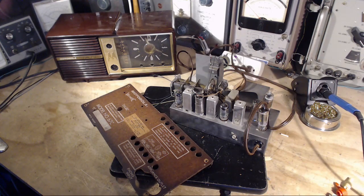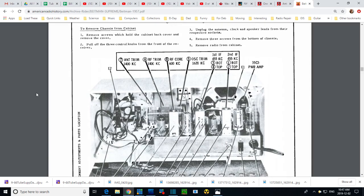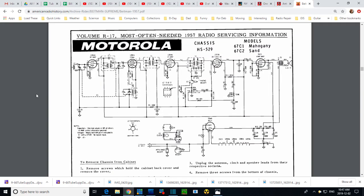This radio was made in 1957 — a lot younger than I thought; I guessed 1949 or 1950. Here's the schematic — it's a one-pager from Beitman's. They have a nice diagram pointing out all the key things. I'll just follow the signal through. We start way out here at the loop antenna mounted on the back of the radio — just a loop of wire — and it's hooked directly to the tuning capacitor.